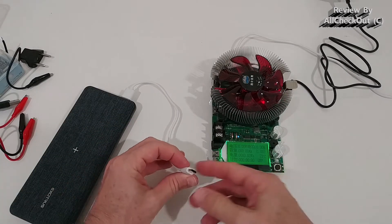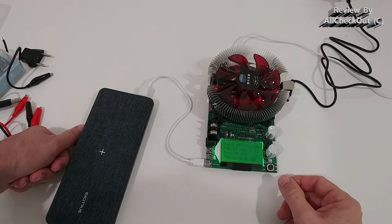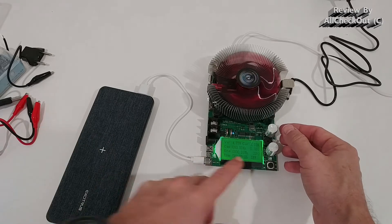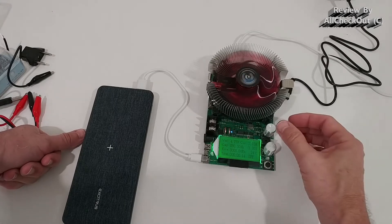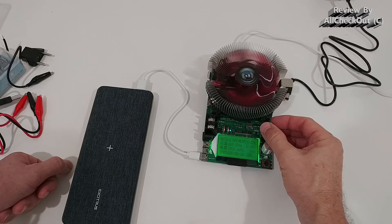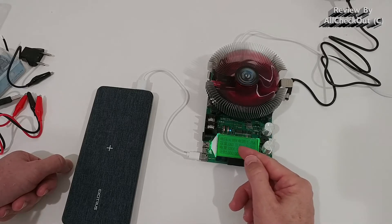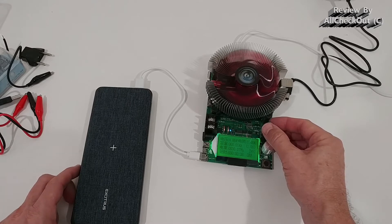Still, I'm going to try to discharge a USB-C power bank — at least this plug is USB-C. It says 5 volts. Let's increase a little bit — okay, that goes up pretty fast, that's crazy. We're already at 2 amps with just rotating a little bit. There's actually no start button — you just increase the amps or reduce the resistance and it starts automatically, counting watt hours, amp hours, milliamp hours. I can see this is definitely more intended for real high power devices.